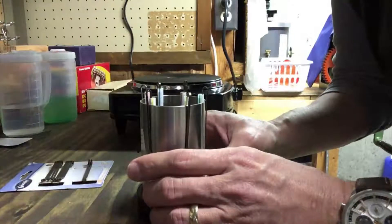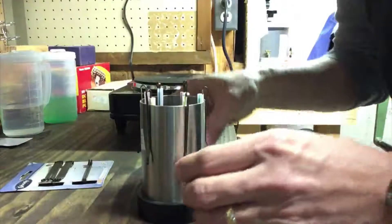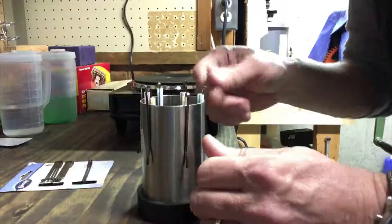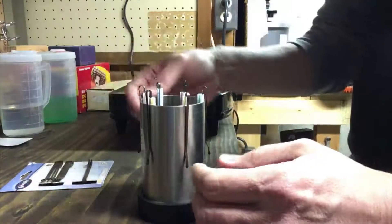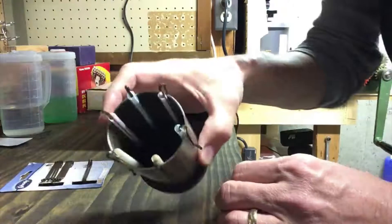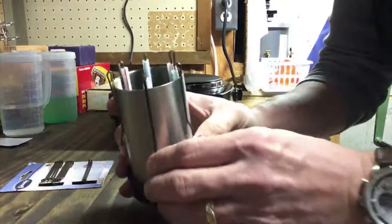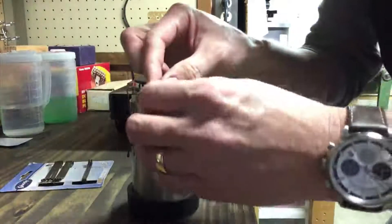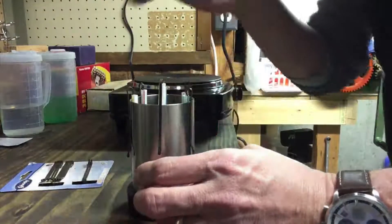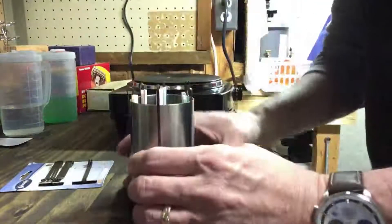You want to keep it about a quarter of an inch away from the wax at all times, because if you get it too close or if it actually touches, you're going to be in trouble — when you pour the metal in, it's actually going to fill up the tubes. That's how I use my straws for casting. During the burnout cycle, even though these are plastic, the oven is so hot that it'll completely burn out that plastic, so all you'll have is a cavity inside.